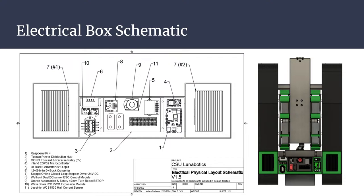And then the final thing is right there. We have an I2C PWM splitter. So it basically takes like two pins from like an Arduino or a Pi. It has like a timer and like a data transfer wire. And it turns basically two wires into like 16 outputs. So we're going to use that to control the two drive motors and then probably also inevitably the digging motors.